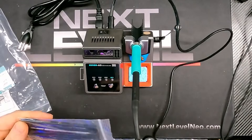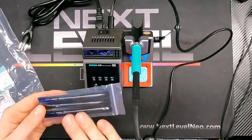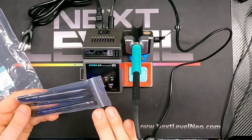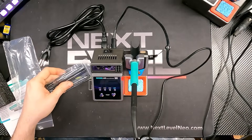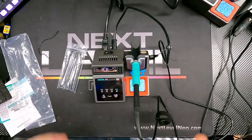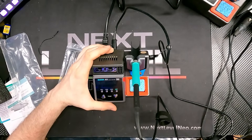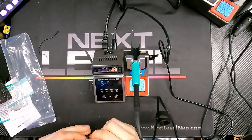These are the three separate style tips: the straight tip, the angled tip, and the broad tip. This particular unit is the 245 with the larger tips; we also have the 210 with smaller tips — if you're doing something more intricate like circuit boards, you'll want the 210. Once you plug up the unit, there's a switch in the back to turn it on and off — flip it and it turns right on. It does chirp if there's no tip present.